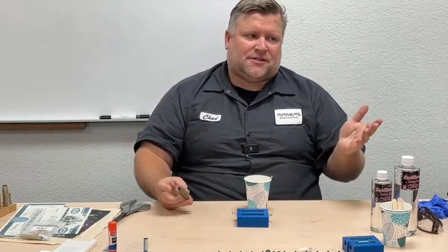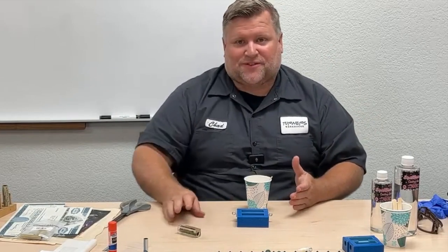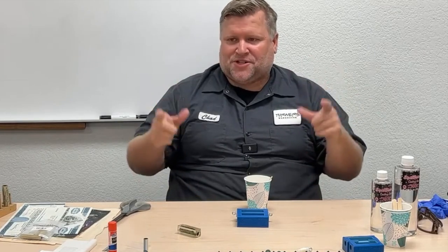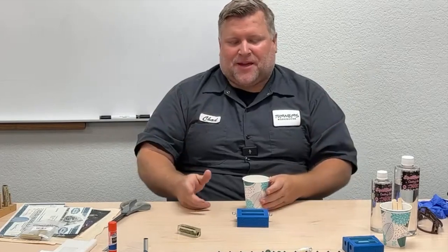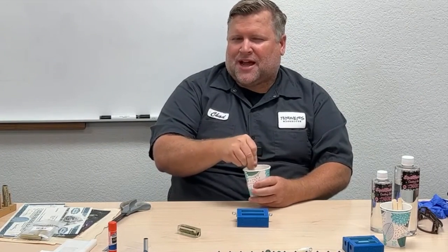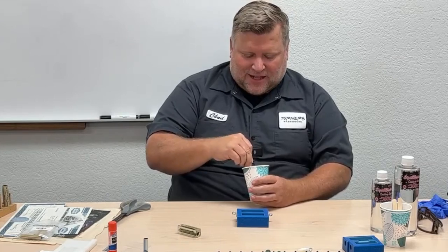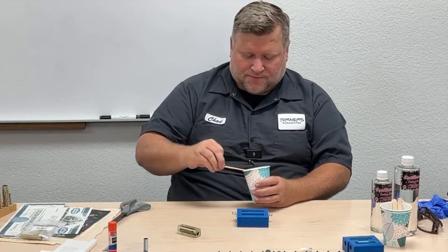And actually, to be honest with you, I live in Arizona. I don't warm anything ever, because I'm always trying to cool everything. But even block molds and stuff, I don't warm. Occasionally I'll have a little corner wicking or a little pullback, but not enough that it makes a difference. If you're in a cold environment, you might be better off warming the mold, so you'd have to kind of experiment for that. But because of my climate and temperature, I don't warm molds. But that's a good question.